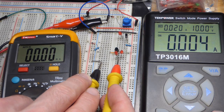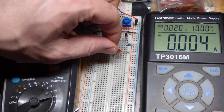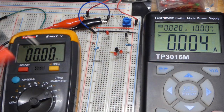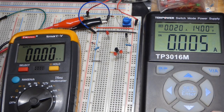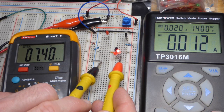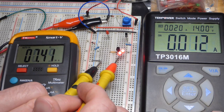You may notice this LED is a little dimmer — that's just because it got abused at some point, probably too much current. You can see a lot less current is going through the two. If you use brand new LEDs they'll all be the same brightness — some of these I abused. The current is lower because we have too much demand for 10 volts, so we are going to adjust this to 14 volts at the rail. And now you can see it's holding steady.